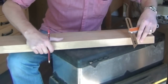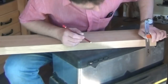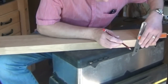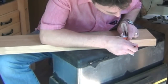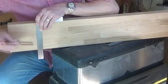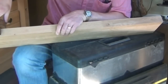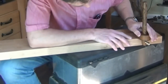Now I'm going to mark out the dovetail that attaches the feet, using this bevel gauge which I've set to the same angle as my dovetail bit. I'm going to cut this one by hand, just to show those of you who don't have a router that it's perfectly possible to make this without one. We want the dovetail to be in the centre of the feet, so we mark it out in the middle between the two markings made on each end of the foot. Once we've marked the dovetails for each foot, we transfer those markings to the underside and repeat the marking on the front side of the board. Using a marking gauge, I mark the depth of the dovetails at half an inch on all four points, and then we're ready to start sawing.